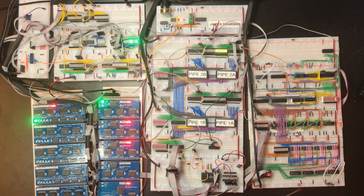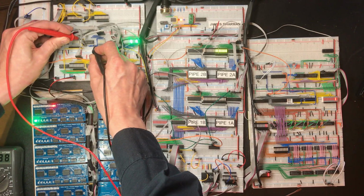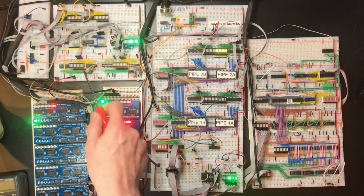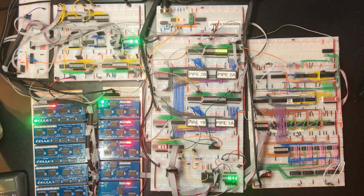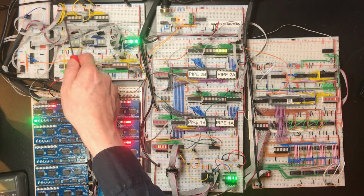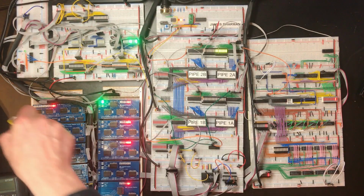Let's look at everything that could possibly be going wrong there. This is a 74LS139. It's got 4.98 volts on the power input. That's excellent. Now, that inverted clock comes from over here and it goes into 5 chips. These are LS chips, so the fan out into them should max out at 10. But things did start going weird when we added this chip. I'm just going to pull the clock line from it. Right, we're still getting the double clock, so it wasn't that.